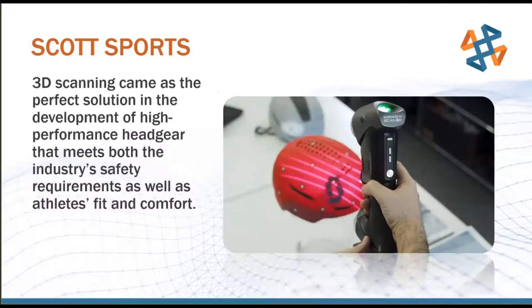So either molding something out of clay or carving it out of foam, something that the designers created with their own hands right in front of them, they can get a fit and a feel right away, and they see what they like, and then they can digitize that with the 3D scanning solution. So this is a less traditional workflow where we start with a physical prototype and then digitize it into CAD, whereas in other workflows you might be more familiar with, we start in CAD and then create a physical prototype off of that.